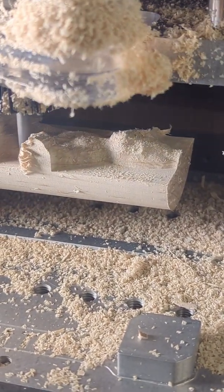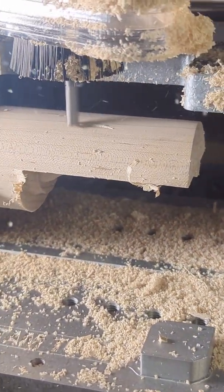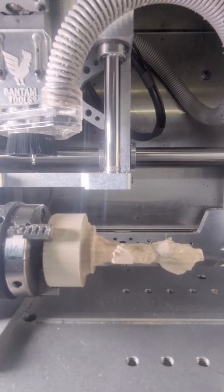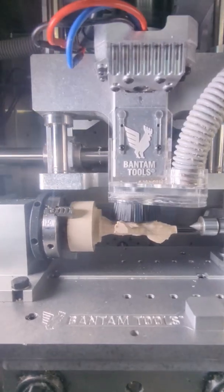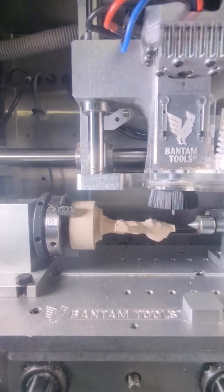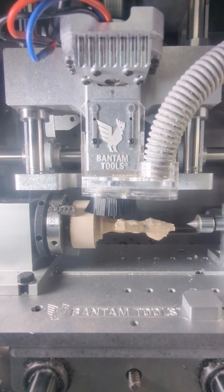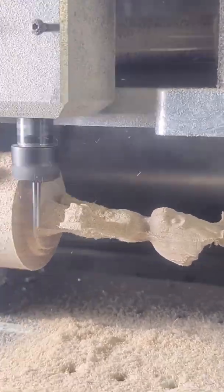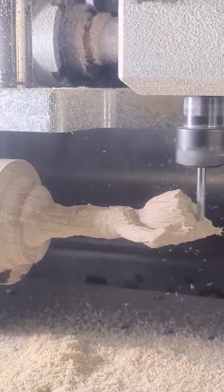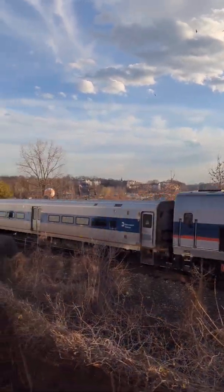I'm going to start off with a quarter inch flat end mill through our adaptive passes using the vacuum. Anytime you're milling wood in our mill, you're going to want to use a vacuum for that. The only exception might be if you have really close calls and really tight tolerances. As you can see on this pass, I'm coming really, really deep and I'm seeing that there's a possible collision, and I don't want to risk anything like that. So pop that bad boy off to finish up our contour passes.